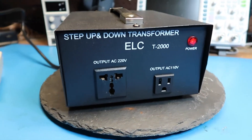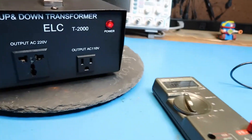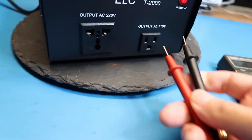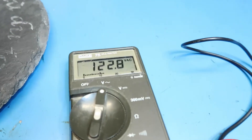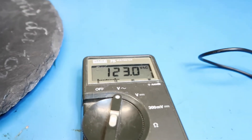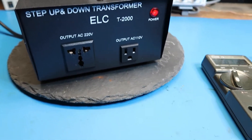We are back at the front again. I see the power light is on, which is good. I'm going to plug in my AC voltmeter and find out what we've got. It's showing approximately zero right now as expected. I'm going to plug into this 110 outlet — showing 123 volts, as opposed to 122 on the watt meter. Now we're down to about 122, so that appears to be a 1:1 voltage — which is what I'm looking for. I've got the voltage switch set on the back for 110.